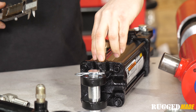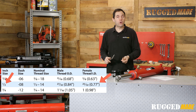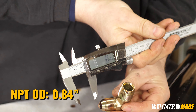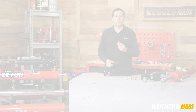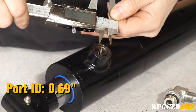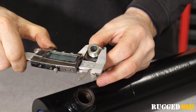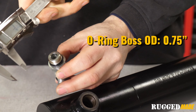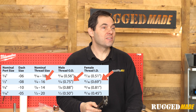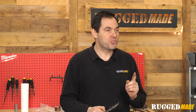Let's look at another example. The ID of this port measures 25/32nds or 0.77 inches, and that correlates to a nominal inch size of half inch. This male fitting OD measures 27/32nds inches, which also correlates to a nominal inch size of half inch. O-Ring Boss is not intuitive either. This female port measures 11/16ths inches or 0.69. The male fitting OD is 3/4 inch or 0.75. The nominal port size for both of these is half inch. The corresponding thread size is 3/4-16, and the dash size is SAE-8. As you can see, there are a lot of ways to describe just one size of O-Ring Boss connection.